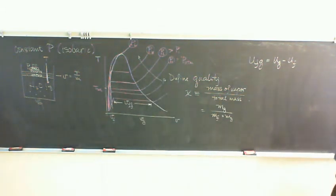Saturation pressure on this particular table. That's it right there. That's the pressure that you would need to put the system at for it to boil at that temperature. At 45 degrees, yes. If we're at some other pressure, there's some other boiling point. And the other table, the saturated pressure table, is exactly the same, just calculated on nice fat values of pressure. And when you pick a particular pressure, right there is atmospheric pressure, and the boiling point is essentially 100 degrees, as you knew. These are exactly the same tables. You use the pressure one if you have the pressure value. You use the temperature one if you have the temperature value.